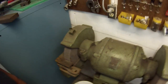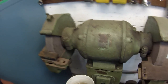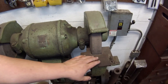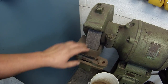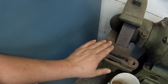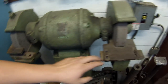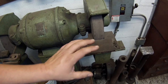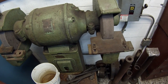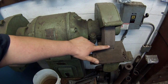Here's my pedestal grinder — it's a very old Queen City. If you look at each side, you'll see the tool rest. This side for the coarse wheel is the correct height and it's adjustable on the side. You can adjust this plate up and down, and it pivots — you can move it in and out. This one's always been fine. This side over here, I don't know what happened, but it's always been this way and I've always wanted to fix it. I'm tired of dealing with this because the tool rest is below the center line of the wheel.